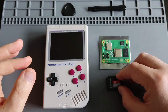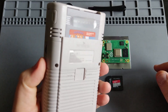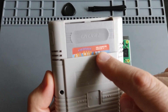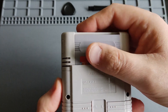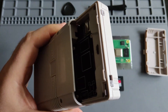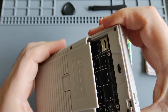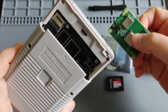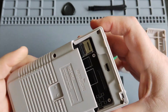Once the image is copied onto the micro SD card, I'll show you how to put it in the device and also how to install the CM4. As I mentioned in the previous video, it's quite simple — you don't have to take any screws out. The CM4 module slot is inspired by the Game Boy cartridge design. There's also enough space to install a heat sink if needed, and you can see the outlines showing how to align your CM4.